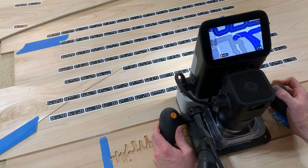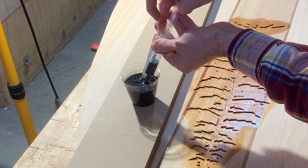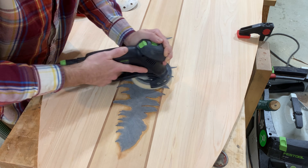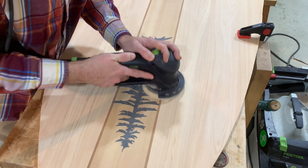A little bit of a sand-up, then adding penetrating epoxy so when I fill the tree with tinted epoxy, it doesn't bleed into the grain all over the place. That's just a two-to-one with a slow hardener — let it sit for a couple hours and it'll be hard enough. I mixed a metallic pigment in from Black Diamond and it looks great. Using nice glue syringes from TotalBoat, I overfilled the tree a little bit and then sanded it down. It's way easier to overfill and sand down than to underfill and have to sand the entire board down to a low spot in the epoxy.